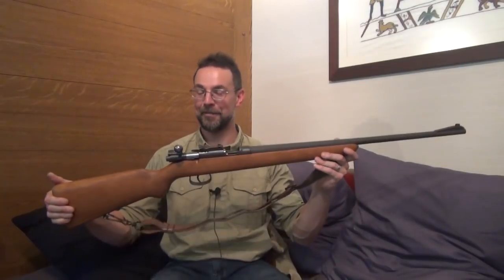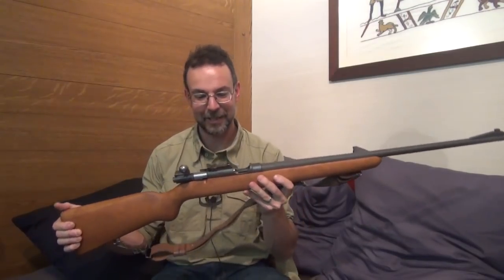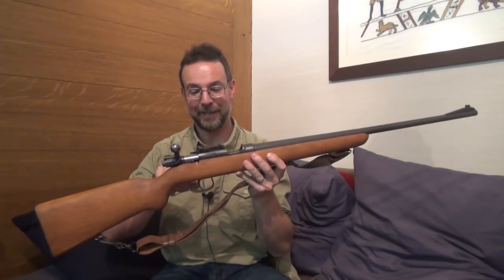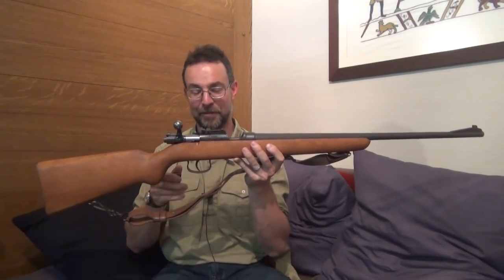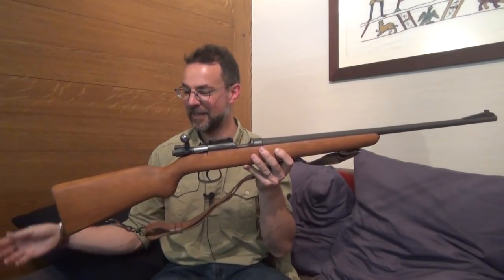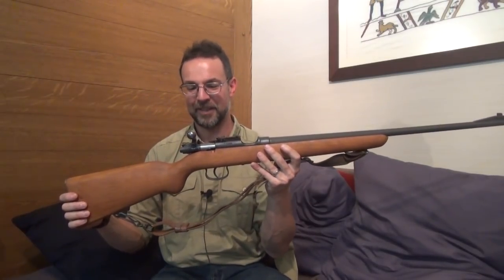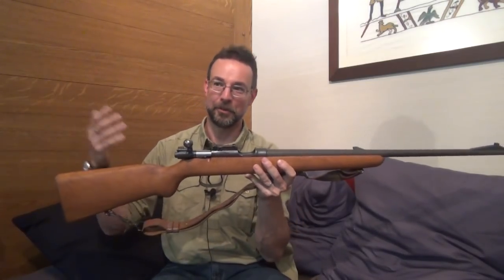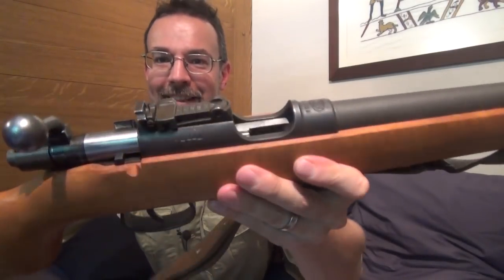So we essentially have a hybrid of 3 pre-existing Mauser .22 rifles. We have receiver and bolt, which are straight off a KKW. We have the repeating mechanism, magazine, and trigger guard of a Mauser 410B, and then we have basically the stock fittings, barrel, and very nice front sight here, which are of a Mauser ES 340B.